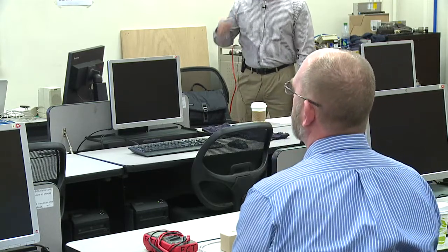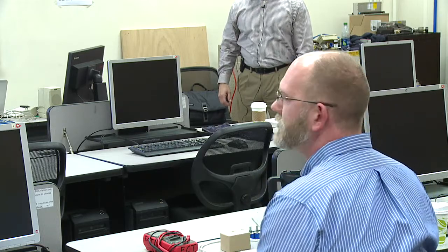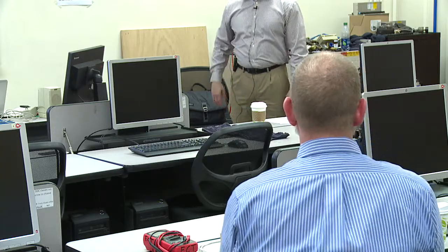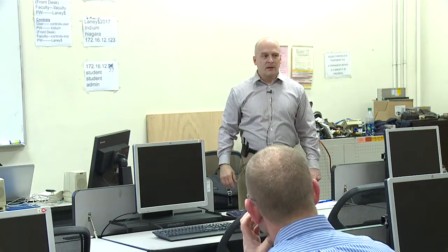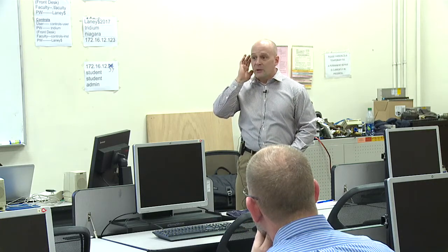So it's off. Well, with a live zero system, you should always have a signal through it. So if you lose that connection, you lose your signal, and you now have a fault and not a zero. Great explanation. And it allows for an alarm condition, even when nothing's going on in the circuit. When it's just at a stable 4 milliamp state, and you really don't have the transmitter sending much of a signal, it gives you an indication that you have a complete path for current flow, that you have continuity, that you have a DC power supply, that your transmitters, you know, it tells you a lot of stuff immediately.